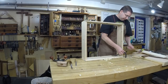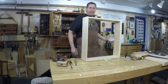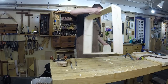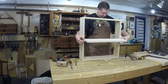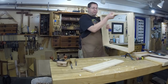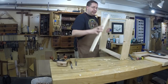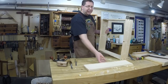Now I just need to take my shelf piece and size it down to the exact length so it perfectly fits in these dados. Right now I'm about three-quarters of an inch too long. And lest I repeat the issue I had with this case before, I need to narrow the whole board down so it's the same width from the front of the case to the start of the rabbet. Right now it's too wide — this is the same problem I had before that caused me to have to remove material after the case was assembled. Lesson learned — let's not repeat that.